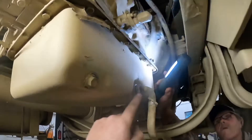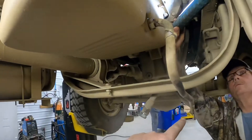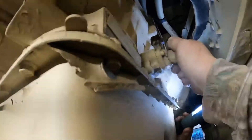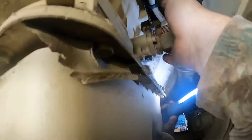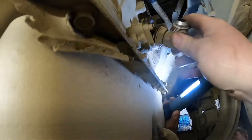We've got the oil drained out of the pan — put the dipstick tube back so it's not dripping. Got the lower cooler line off and the other one out of the way. We loosened this cooler fitting and we'll drill and tap it for the lube line. We'll drill a hole in the end and tap it.